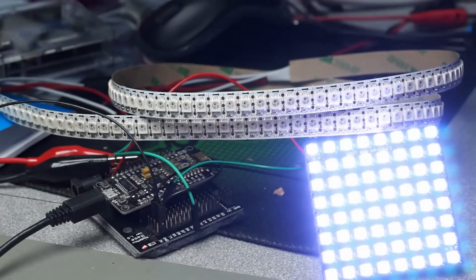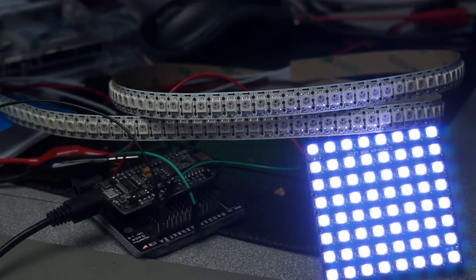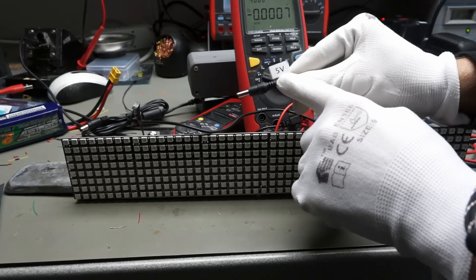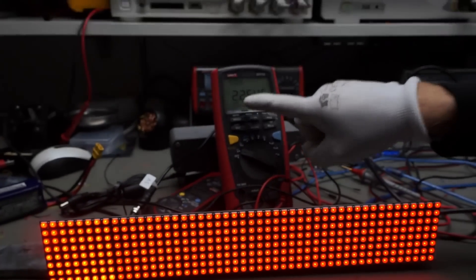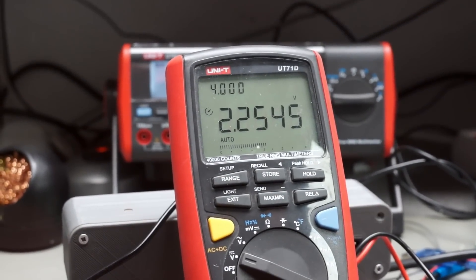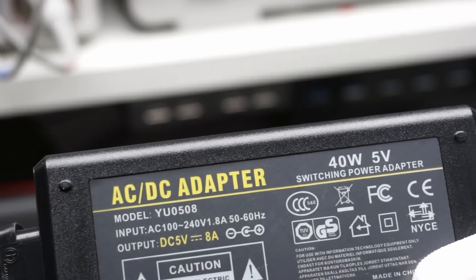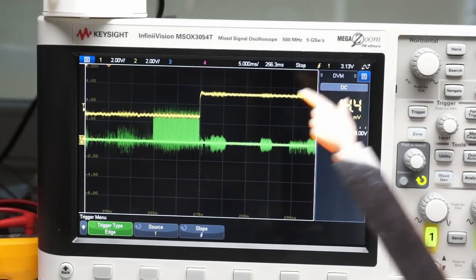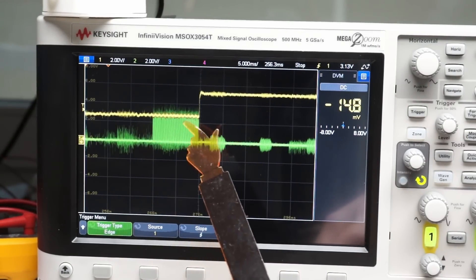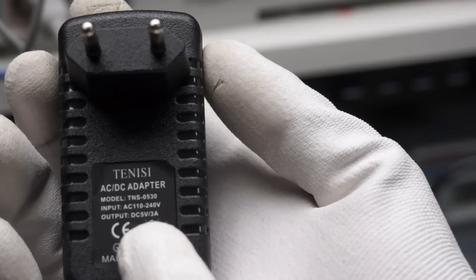I forgot to mention something disagreeable. We already discovered that if we do not supply any data to the WS2812 chips on the panel, they switch to full white after powering up — with a devastating effect: a huge current draw. I started with a 5V 1A power supply from my old counter, and the ESP always crashed because it did not get enough voltage to power up and switch the LEDs off. With pixels switched off, 1A would have been more than enough — a typical catch-22. Using an 8A power supply, the current draw is more than 5A. On the oscilloscope, we see that as soon as the matrix gets data, the pixels switch off, current is reduced, and voltage jumps up to 5V. A 3A power supply is sufficient to start the ESP8266.